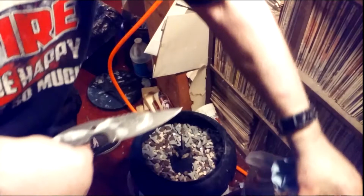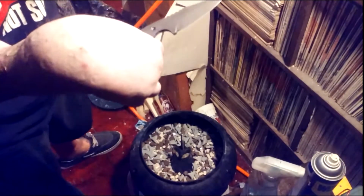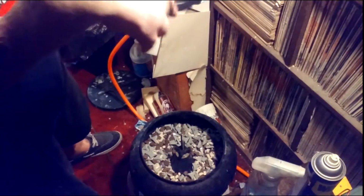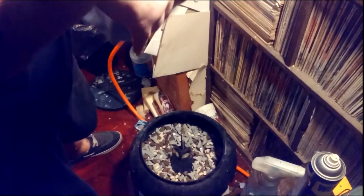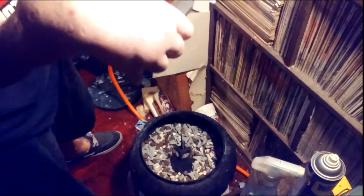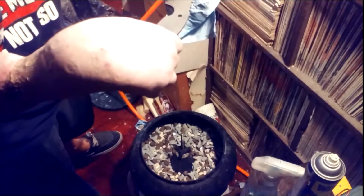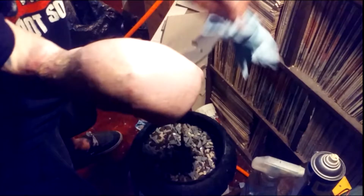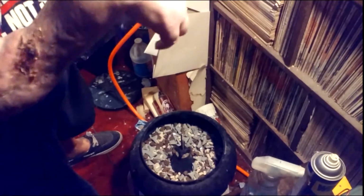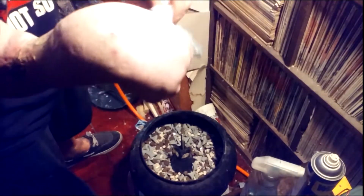And I have done everything with this stone washer. I've tried everything. And that's finally it. You just have to soak them down and then cover it with WD-40. If you get them all wet, you don't put the WD-40 in, you can barely see the stone wash. And if you don't get the stones wet, then only one side gets done. Man, all kinds of problems. So, yeah. Really wet stones and WD-40 seems to be the mix, at least for this one.